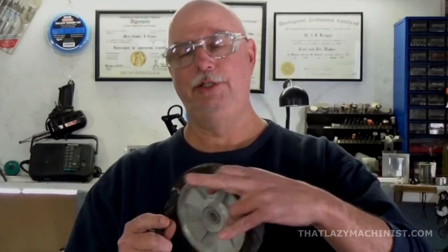There's two things that make the drilling of this hole dangerous. And the first is, well, that the hole already exists. And if I use this twist drill to come and drill the hole, well, the chisel end or edge of this twist drill won't meet any material or have anything to push against. And that's very dangerous. Now, you may not know what a chisel point is. I'd like to say that isn't important. But if you are drilling and you don't understand the twist drill geometry, well, you're going to get yourself into trouble. So, here's a video that can help you out with that.